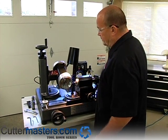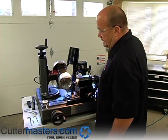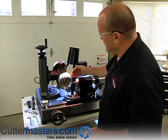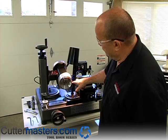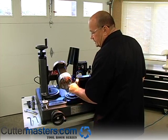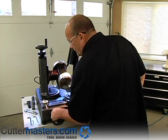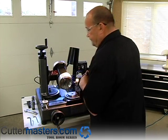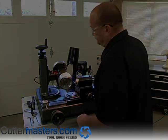So now I'm going to lock this carriage. That's your setup. So now we've found the center of the X axis, the Y axis, the wheel's at a good height, and we know where the tool is from this height. So once we're done with this pin, we can just take it out. And now I'm coming back to my zero this way. On the Cuttermaster Pro, clockwise is always feeding. And so now I'm good to set my end up.